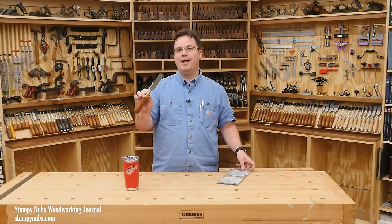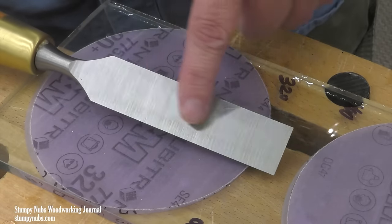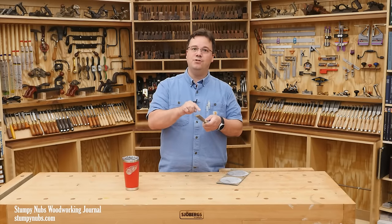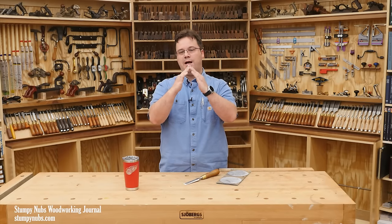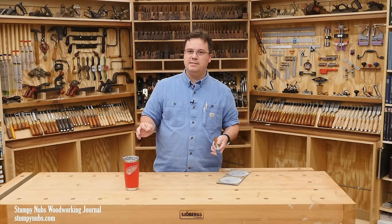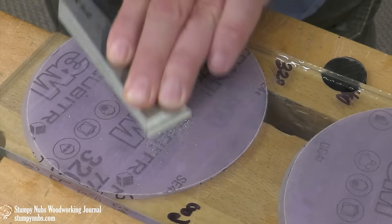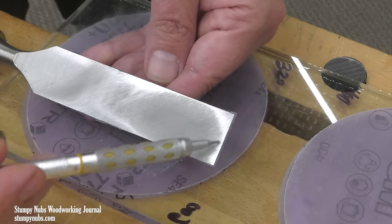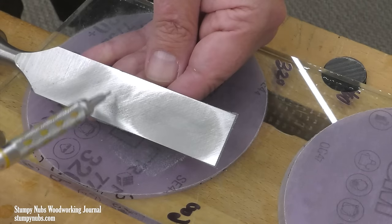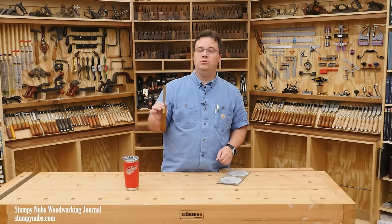Today I'm going to prep a brand new chisel. What a lot of folks don't realize is you often have to do a lot of work to get a new chisel ready before you use it the first time — it's not just a matter of honing and polishing the bevel. You also have to do the same thing to the back, because a truly sharp edge is the confluence of two polished planes. The problem is new chisels, and most older vintage chisels you find second hand, don't usually come with flat backs. This one certainly looks flat, but look what happens as I rub it on the sandpaper — the scratch pattern reveals a deep hollow in the back where the reflection appears dull.